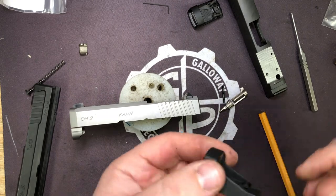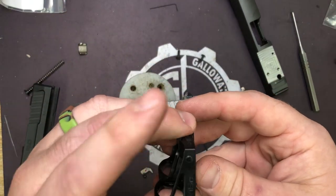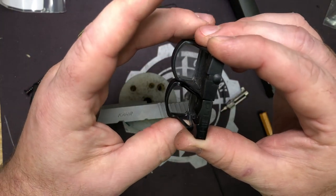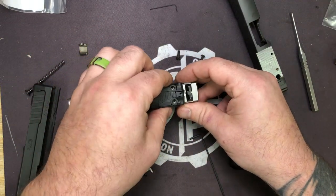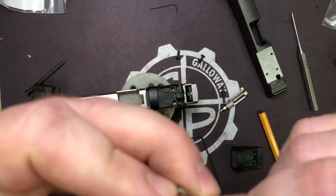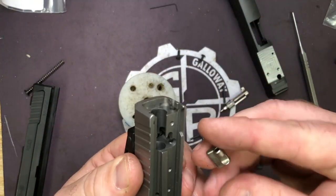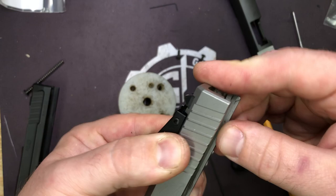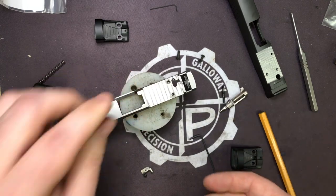With the J-Point we don't have to go as deep as we do - well, actually about the same depth as the RMS. The difference being the body's a little bit different on the RMS-C, RMS-W, and all that, and it's not quite as tall. The same cut will work for either, but notice that's all been shaved down and smoothed off. You've got to put that in place, and if the bottom of the optic blocker doesn't get out of the way, the striker doesn't go forward.